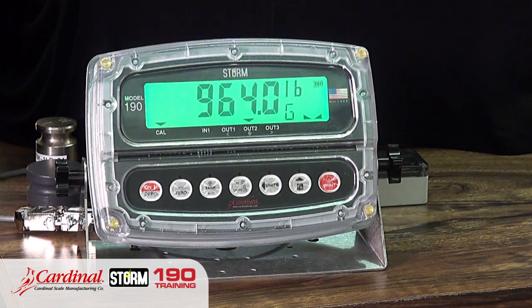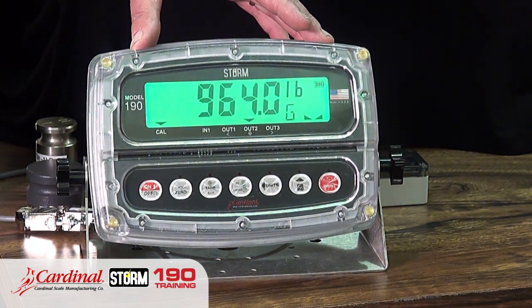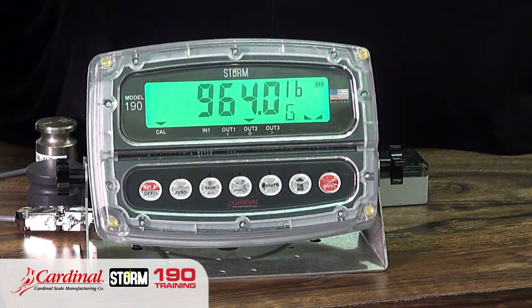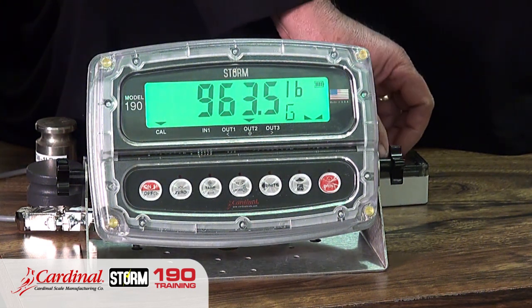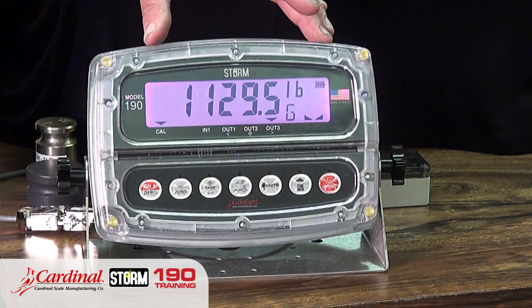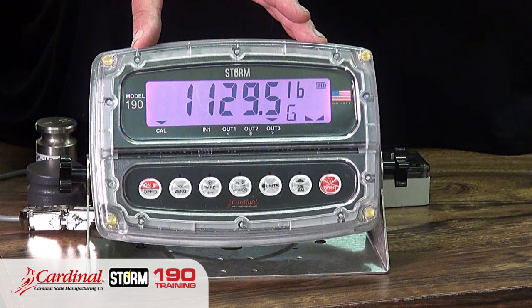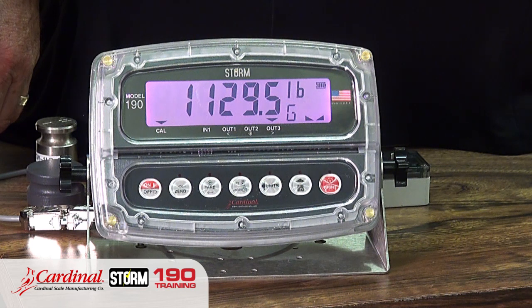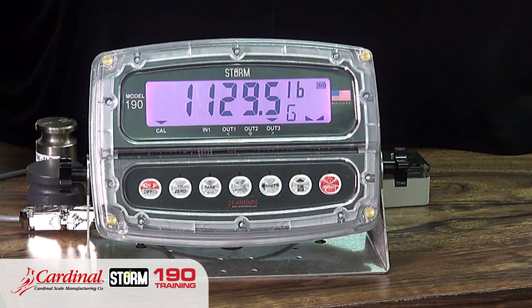As a review of color zone: we have amber, green, and red for exceeding weight limits. But there are multiple colors within the 190 that make it a very flexible unit. You can set one color as a default — if you're not using the check weighing feature but like the green display, that can be on at all times. You can also turn off color for the transflective outdoor display, or change colors for specific applications. We even created a pink color for distributors to recognize Breast Cancer Awareness Week — a complete food processing plant showed pink on all weight indicators, very popular, then reverted back afterward.